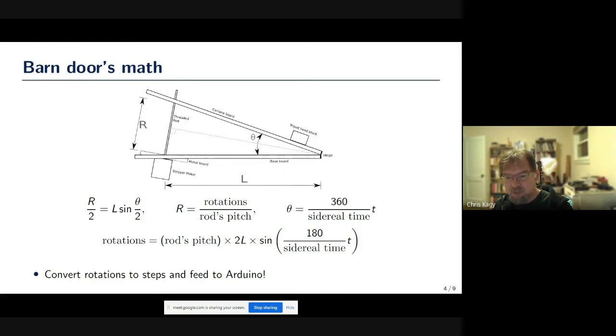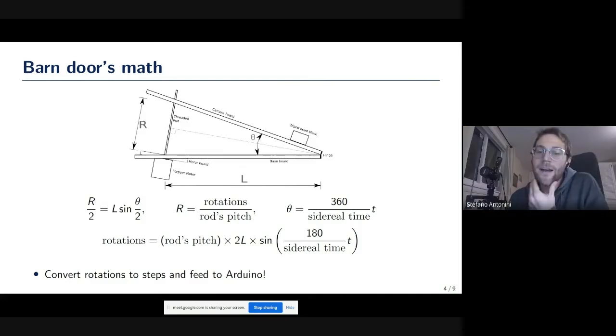And I assume it's the sine function that is too heavy for the Arduino. That's what I read. And I suspect it's also true because, just hearing it, the motor is not constant. It sometimes slightly slows down and then accelerates again. I timed that, and it happens every 5 seconds, which is when it computes the sine. So I suspect that's the case, but I couldn't really see an effect of that on tracking. So I figured that it can probably be done better.